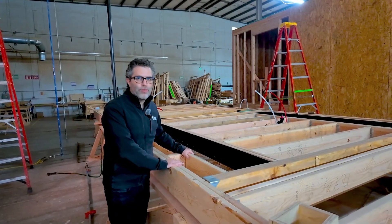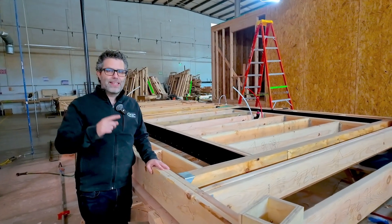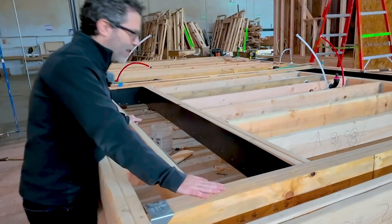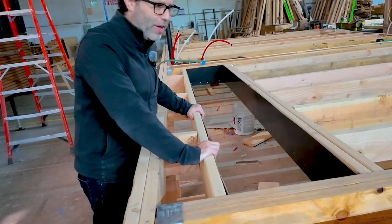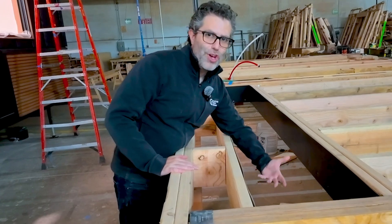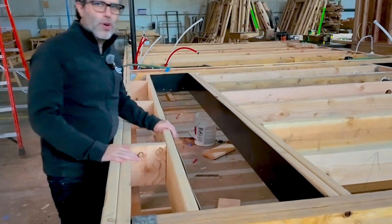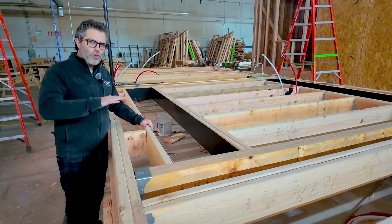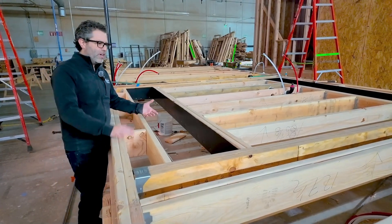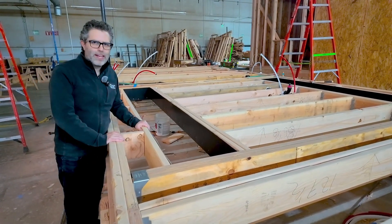This is a subfloor for a Clever One. There's no trailer here because the trailer will be added later. The second thing you'll notice is this framed-out area here — this is effectively the new wheel well. The subfloor decking goes on top here and the wheel is able to ride up within here. This allows us to keep the home relatively low but not have the wheel well stick through. The floor of the home when on wheels is a little bit higher than it used to be, but it's just one step — not a huge amount. We also provide insulation that goes in here when the home is parked, so everything is fully and nicely insulated.